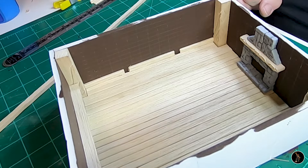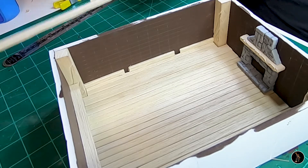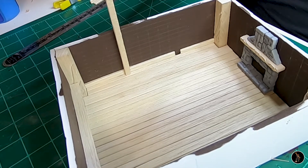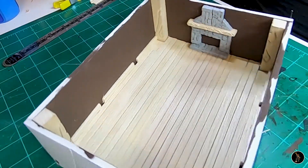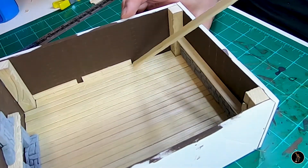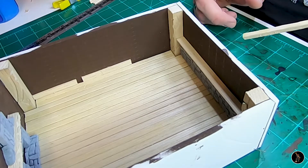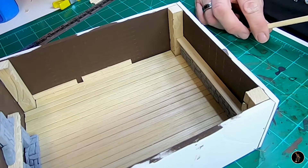I want to start putting the wood paneling up. I'm going to put some kickboards down and there are gaps in them because I want to be able to put some beams up — I don't want them butted up against the kickboard, I want them against the wall. On this side you'll notice there's an opening because that's where I'm going to put the door, so I don't want a kickboard going across there. I'm just going to have the beam here and put the paneling or wood siding the rest of the way across.